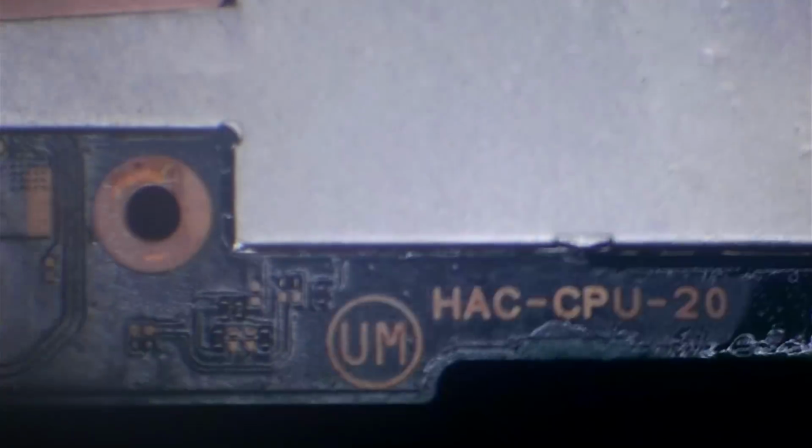Okay, let's just clean up. Okie doke. And we're pretty much good to go there. So there is a little bit of solder there still, so I'm going to try and clean that up before I install a new port. There we go. And let's just inspect these pads. Absolutely fine. Excellent. Okay. So I'm going to get a new port installed now.